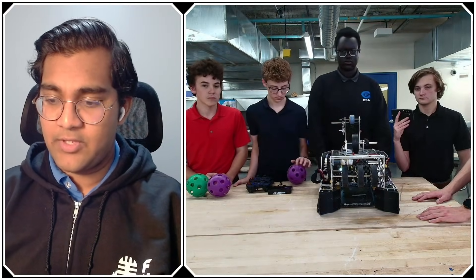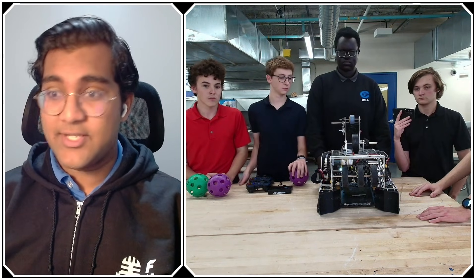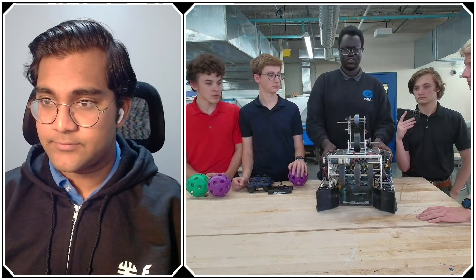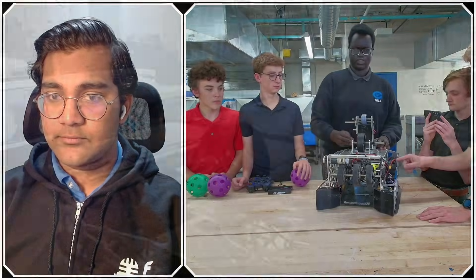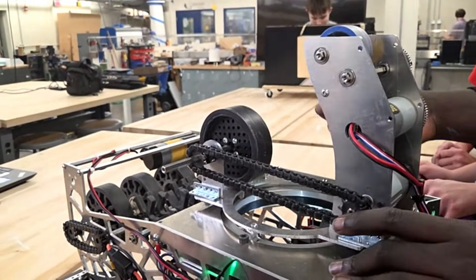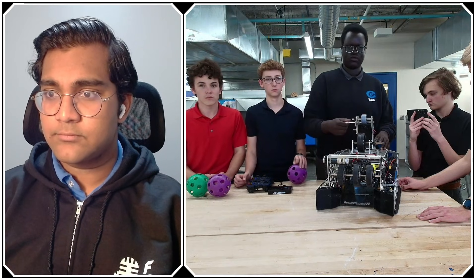Talking about spin-up time and time between shots — a lot of teams have added counterweights or flywheel weights up to three or four pounds. You guys have absolutely no weight on your shooter. What has that done for your shooting time, and why haven't you added any weight? On our original shooter we did have a steel flywheel, but making this new version — going from two motors powering the flywheel to just one — we tested having a single rhino wheel with nothing else. Since our kicker takes a moment to launch another ball up, the recovery time between shots was quick enough that we could still use a very light wheel, which also helped increase our spin-up time in auto, cutting it down around a second.